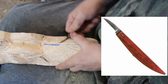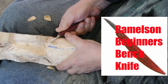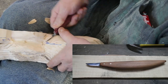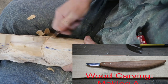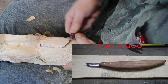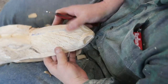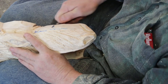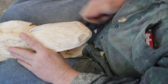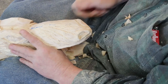Switched to a knife — that's a Ramelson bench knife. Quite fond of it. Comes really sharp right out of the box. It's touted as a beginner's knife, got a real nice shape. I made another video — search the channel Studio on the Lake — there's my version of the same, and I go from shaping that bad boy down to making the handle. The blade is out of tool steel, so subscribe for those videos. It removes wood pretty quick, getting the shape down of the nose as it comes out. I will add a couple horns up in there at some point. This thing really has no design; I'm letting it evolve as it goes along.